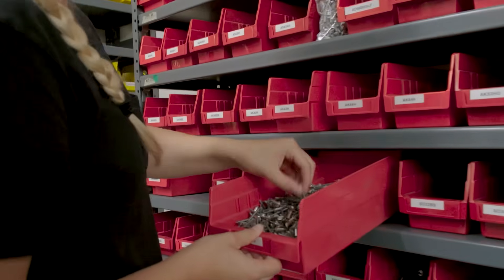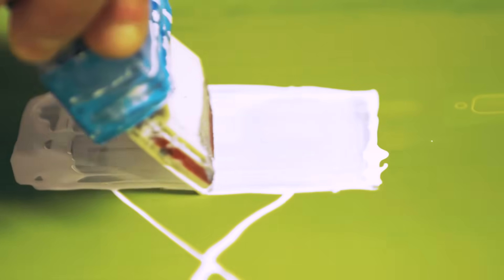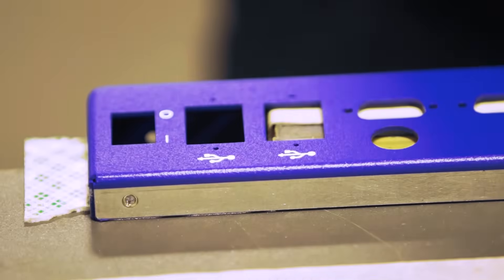Hardware can be inserted into sheet metal components and there are a variety of finishing options available to customize parts like brushing, plating, anodizing, powder coating, spray painting, and silk screening. Cosmetic finishes like these are often critical in sheet metal applications, since many sheet metal parts are visible to the eye — also known as customer-facing parts. It's really important to make sure these parts are very aesthetic.